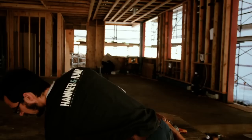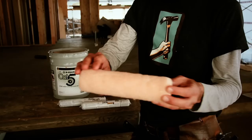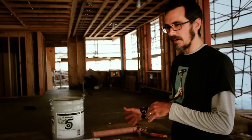The third product is Cat5. This is a product that's rolled out. You can use the bucket it comes in with a roller screen and a roller. This is a 3/8 nap, and it's rolled out. All the exterior walls get the Cat5. One trick we found is you need a pretty heavy-duty roller frame. With the amount of product in it, the roller can wander off the frame, so we take a bugle head screw and put it right there to attach the roller to the roller frame, which counteracts that.